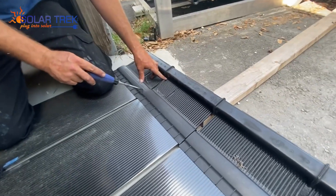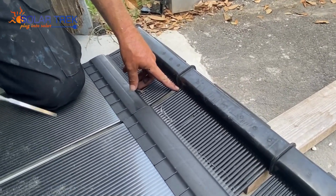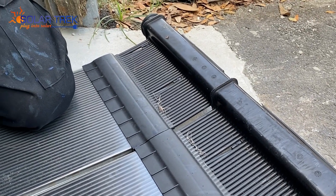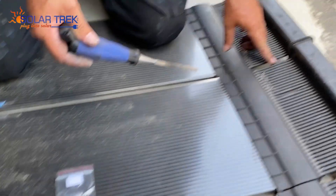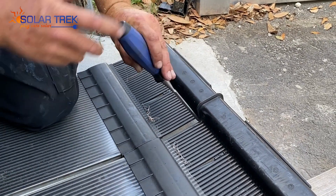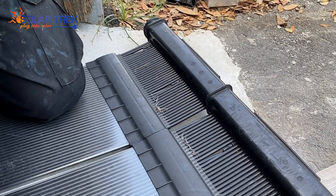We're gonna cut this whole tube out of the equation. We're gonna cut it here and then we'll cut it again down at the bottom. All of our plug kits have two plugs and two inserts. So if this is our tube that's leaking, we're gonna take this chisel that comes with the kit, get it close to the head, give it a pop — makes a nice clean cut.